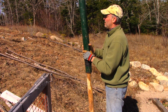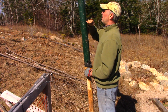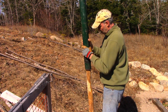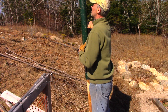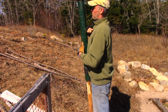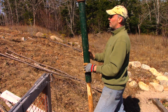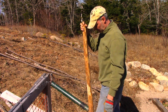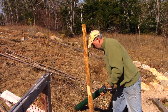Now I've dealt with that problem — got that thing off and I'm hammering the post down. Now it's just a matter of getting it to the height you want and having everything be consistent. What I'd done is walked to the post next to this one and measured it roughly by how high it was relative to my body — around where my throat is — that's about how high I knew it needed to be.